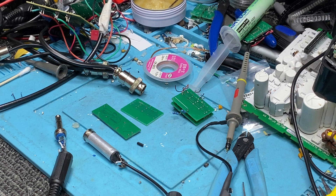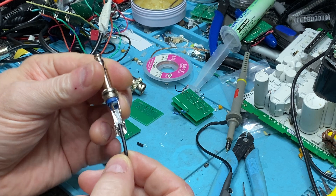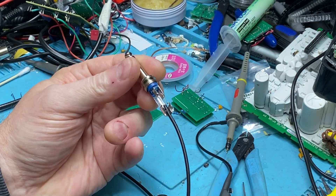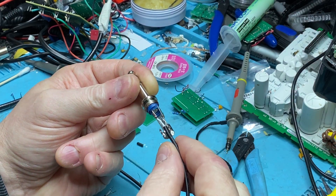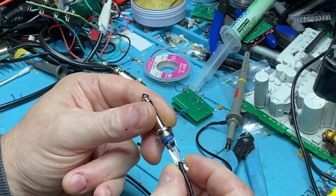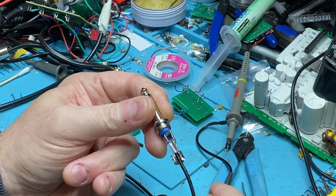I've fixed up others, and I'll just use this as an example. I'm using very thin wire here — this is for one of my own projects and I want it flexible. What most people do is just get this metal bit here and squash it, clamping the wire hard. And all it does is wiggle, wiggle, wiggle where it's clamped hard, and it cuts through and breaks.